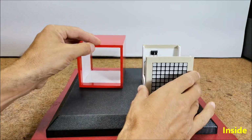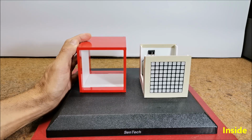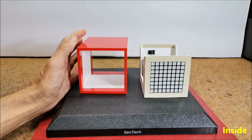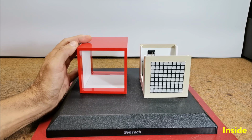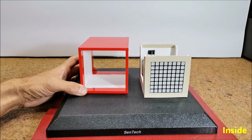The project is very old and dates back to 2012, so the code needs to be compiled with Arduino IDE version 1.0.6 or older to compile without errors. The matrix clock folder contains all the required libraries, so no additional installations are required.